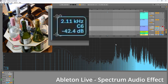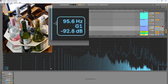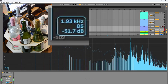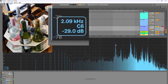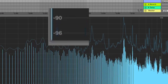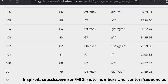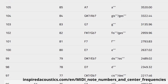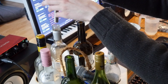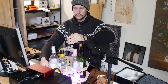I put a microphone next to the bottles. One bottle is playing the same note over and over — this note has an associated fundamental frequency and we can see it in this plot. 2.09 kilohertz — that should be a C6. There's a table containing all the notes and associated frequencies, and if we're off by any little bit we can add or remove water in the bottle. This way we can get the exact right pitch for every bottle.